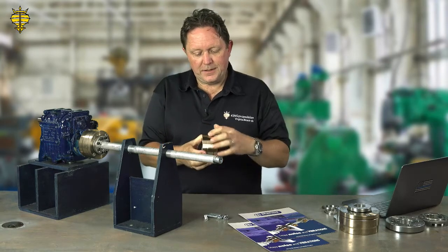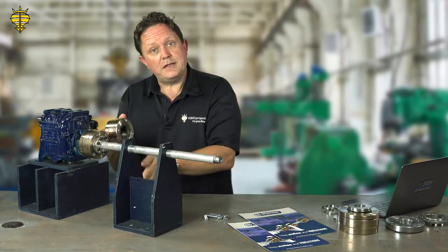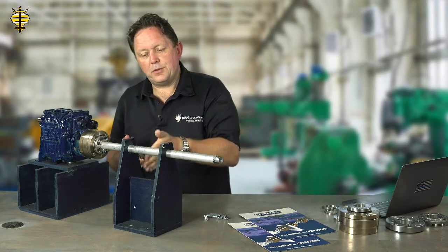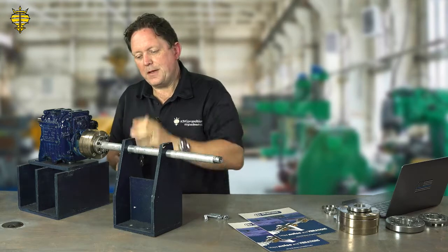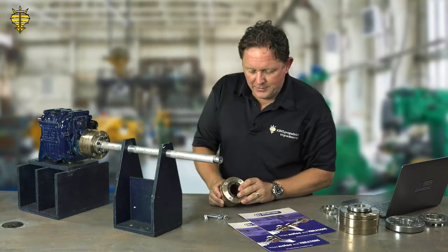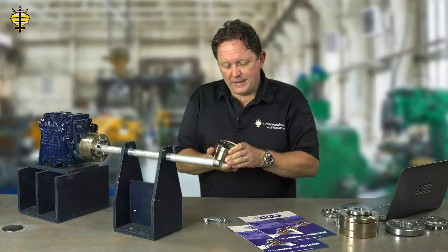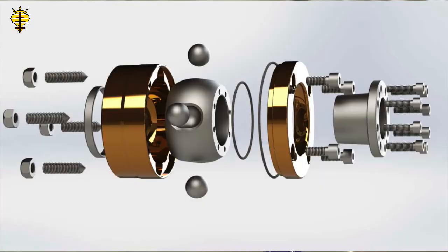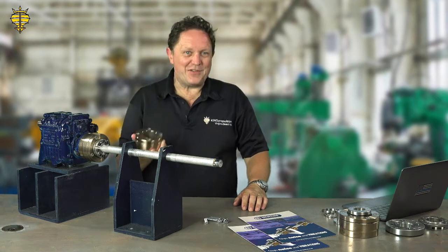Because inside here there's a sphere, and the sphere itself is what takes the thrust load. The thrust will come up the shaft and absorb through the coupling — you don't need a thrust bulkhead. Other systems like AquaDrive require a thrust bulkhead because they use a rubber system, and their rubber bearings squish if you take a thrust load, so you have to have a thrust bearing system in. Sigma Drive has a central sphere that takes the thrust load, and on the quadrants there are ball bearings that take the torque load. The coupling is like a ball joint — like an elbow joint — that can take thrust and torque, making it very unique. It does a lot of complicated things very simply.